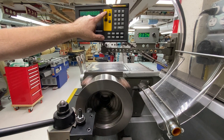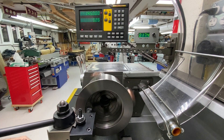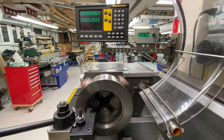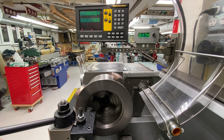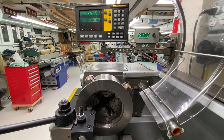Now I'm going to enter that value of 145 into X as my calibration point. I also have the proximity stop set up so I don't come crashing into the jaws of the chuck. Moving the carriage forward, the lathe will cut out automatically right at zero — off the chuck jaw faces. That way, even if I get distracted boring in towards the chuck, I'm not going to crash the boring bar into the chuck jaws.